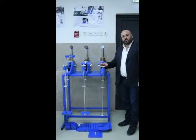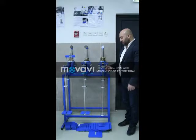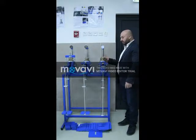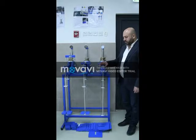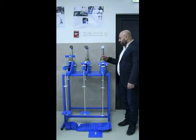What does that mean? It's the ratio of the weight. So every kilogram we put here on the scale will give ten kilograms on the sample if the position is in the middle. That ten kilograms is divided over the area of the sample to calculate how much pressure we are adding on the sample.